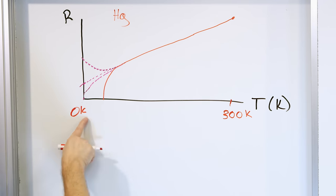Now, just because I've done it a few times, I want to share with you how we measure this. How do we actually measure the critical temperature? What you do is you take your superconductor, which is like, I'm drawing a rectangle, but it could be a puck in a circle. And you make four contacts on the surface of the superconductor. So there's one contact, there's another one, here's another one right here, and here is another one right here. And in order to measure the resistance, you have to run an electric current through it, and you have to measure the voltage that's occurring across it.